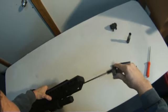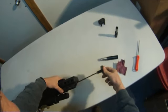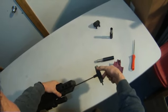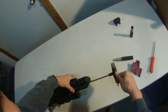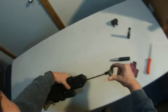If you don't have a torque wrench, I've done this enough that I go by feel. As you can see, just two fingers — just slightly snug is going to be around 15 inch-pounds, so not much pressure at all.